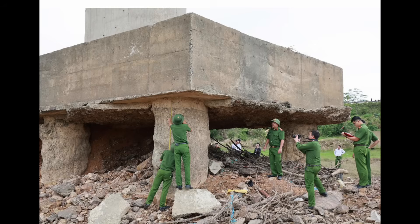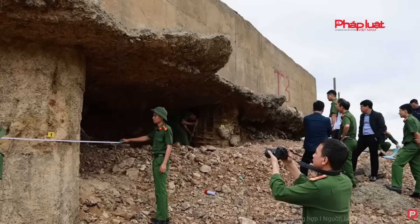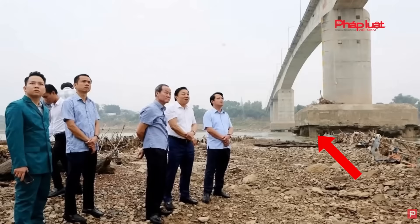Looking at this aerial shot, you can see they have a very difficult situation on their hands. Nobody expects a bridge foundation to look like this. Right now they're trying to figure out what to do. These drilled shaft foundations look to be about a meter and a half, roughly five feet in diameter. They're out there measuring to get an idea of the scope of the problem. It's pretty obvious to me that this isn't something that happens subsequent to construction — this is a construction phase issue with the poor quality concrete.